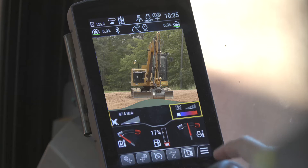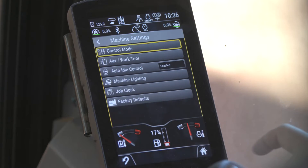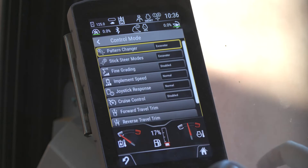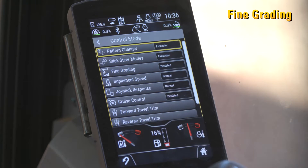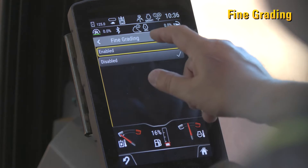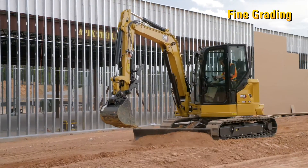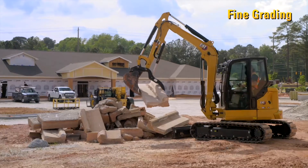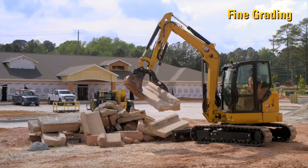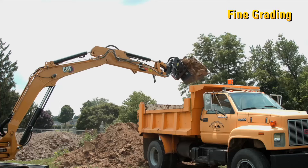In order to get those operator settings, you go to the main menu, you go to machine settings, you go to control mode, and then you see fine grading. Right now fine grading is disabled, and I can go ahead and enable it. Fine grading lets the machine know that you've got a heavy attachment on it — for example, if you were to install a TRS system under this machine, it knows it's a heavy config and the hydraulics will compensate for that.